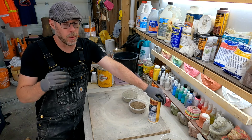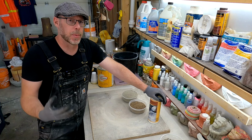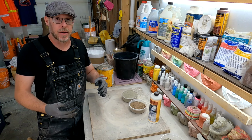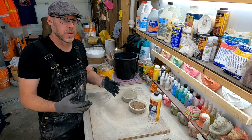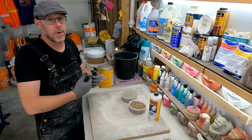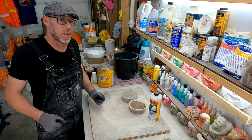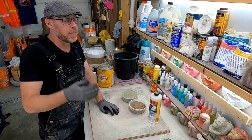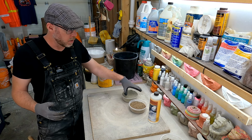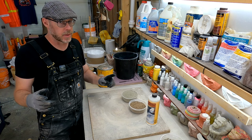For some people who are trying to explore to the maximum degree how well you can do this and replace the bagged products, the self-leveling overlay mixtures, those are the best ones. If you have one of those, they're expensive, but they're an engineered level product. They just didn't use one shovel of this and one shovel of that. They were a little more careful than that. But if you want to get pretty close on those results at home at the benchtop level, 1-to-1 cement to sand, replace half of your water with an acrylic fortifier, and that's going to get you pretty close.